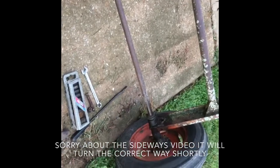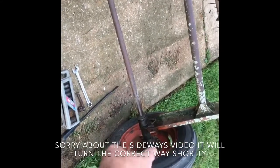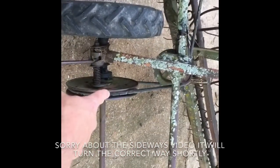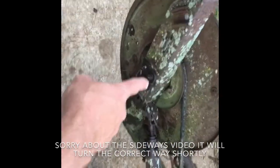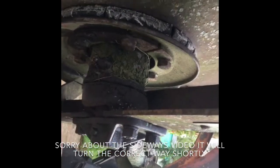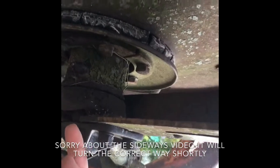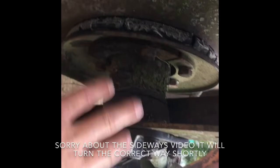I already took that bolt right down there out — there's one bolt that holds it on. I'm going to take the belt around that tire, pull those two pieces apart, pull this piece and the axle apart just enough to slide the belt through, so I can slide it across to that pulley. I'll take these four bolts out and that whole axle assembly should slide out and hopefully give me enough room. Once it's down, I should have enough slack in the belt to slide it over.